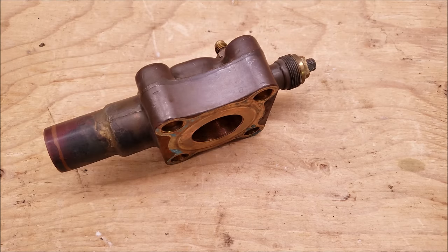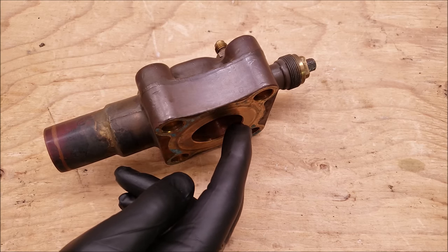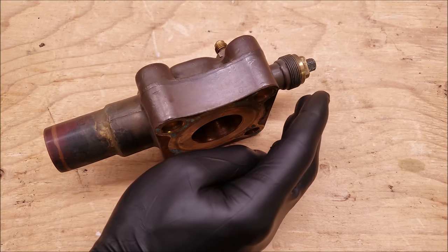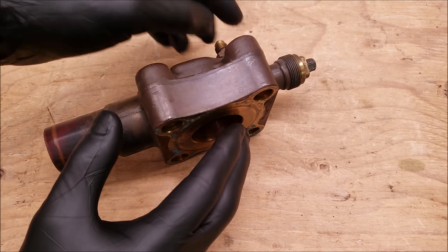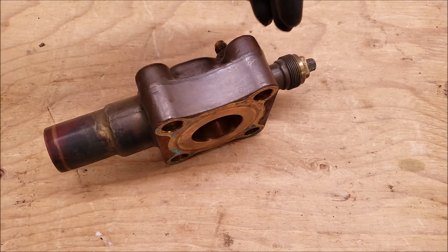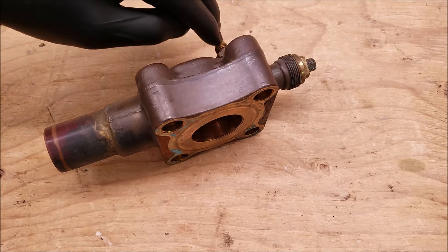So technically that's four positions. You have the front seat, then you have the mid-seat for vacuuming and recovery, then you have the mid-seat which is a small opening and that's for checking the refrigerant charge and adding small amounts of refrigerant, and then you have the back seat position — that's when the system is normally operating and you don't have the hose connected. But any other time when you are working on this system in any of the mid-seats or the front seat, you're going to have the hose connected if there's refrigerant in here, because there's no valve core here to stop the refrigerant flow.